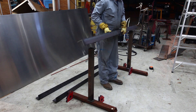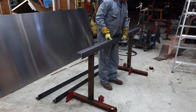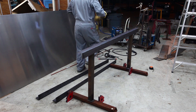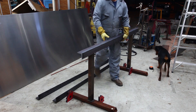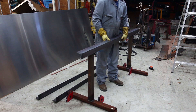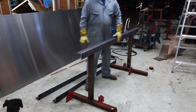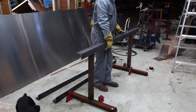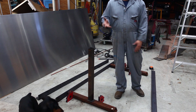First thing I'm going to do is position my first piece of angle iron. I'm going to do this gently because gravity is all that's holding my legs in. I need to grind the front in order to get this to the notch — I'm going to grind off the front edge and that'll let this sit in here completely.